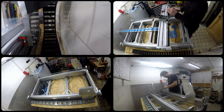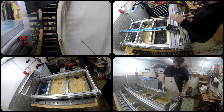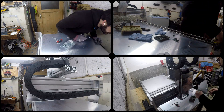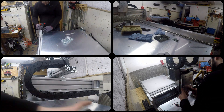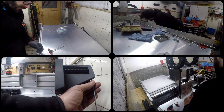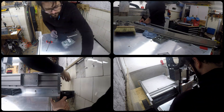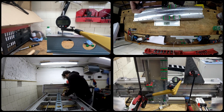The assembly of the portal beam — the X-axis — is especially simple, because it is not just aluminum extrusion but also doubled up with an additional 10mm of aluminum that has been milled flat and square. When assembling the machine, it's good practice to not immediately include the ball screws, or just test-fit them and remove them afterwards, because aligning the machine is a lot easier without having to deal with the ball screws the entire time. Also make sure to assemble the actual machine on the base it will rest on later. With that you're mostly done with the mechanical assembly, and all that remains is alignment — which takes some time but is relatively easy to do.